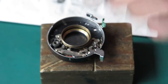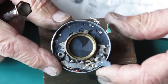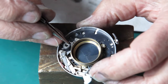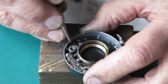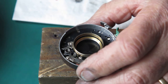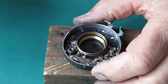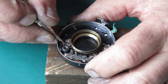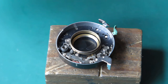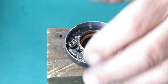Hook it into position - it's so gutless it hardly even hooks into place. But if we cock this spring, do we get shutter? Yes we do. So certainly it would work, but it's good to know that that spring is just gutless - it's hardly got enough oomph to even stay hooked in place. So I'm going to have to find a better example than that. Well, this spring certainly has more tension - you can see how I had to stretch that out in order to get it to clip into place. That'll probably work fine. That's not an ideal spring, but then again there aren't many ideal springs that are 60 years old, so we'll say that that's going to be the one to use.